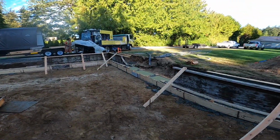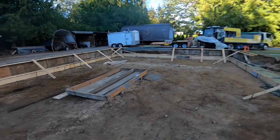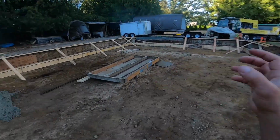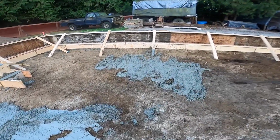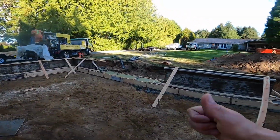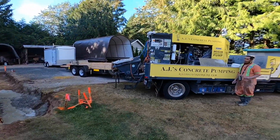Anyhow, that'll be it for this video. Like I said, the only way that could have been even less dramatic is if we had broken off, moved the little compressor down 1 or 2 hoses from the end and pushed it out that way. And even at that, we couldn't get much better than what we had here. This was almost the perfect example. Excellent. All right, that's it. That's a blowdown about as well as any blowdown has ever gone.